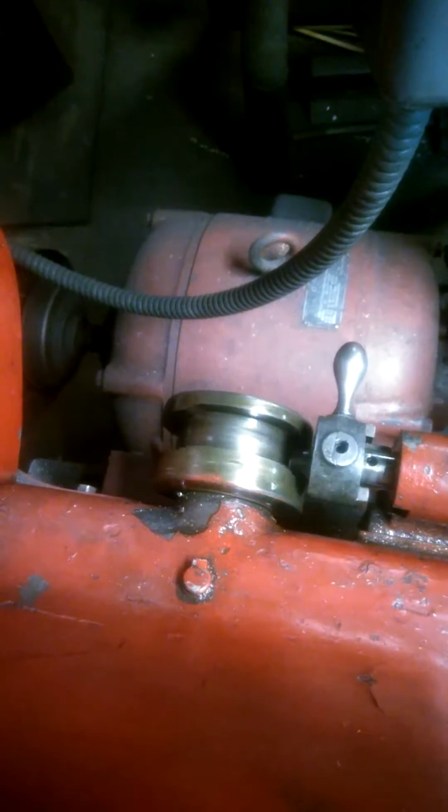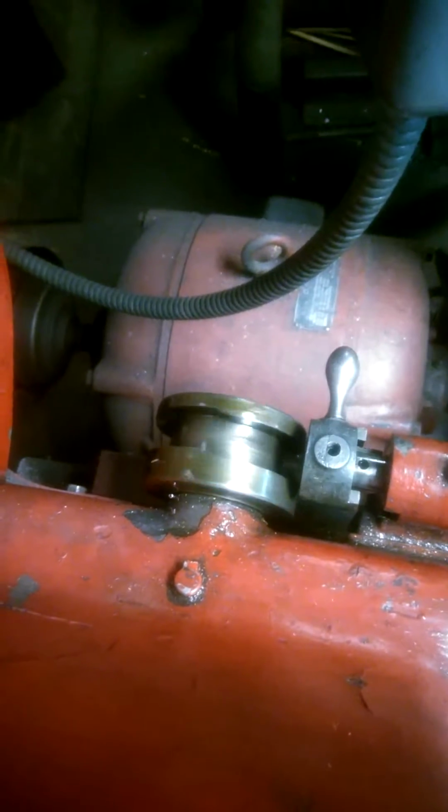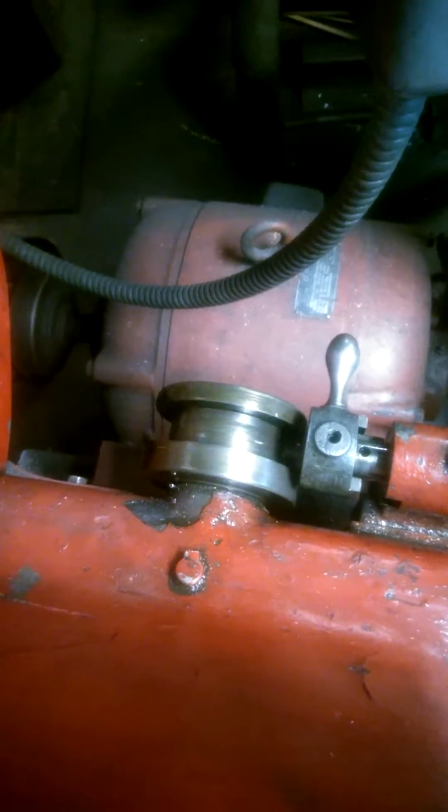Okay, the way this thing works is, in order to put a steep helix in, this machine is basically set up kind of like a lathe. This is a Fisher, and it has a cam. If you want just a steep helix, not a figure-8 groove or a straight groove, you engage that cam, and that comes on down over here, and at the back part of the stroke, it pulls the cutter away, and that's what gives you the steep helix. If you left it in there and didn't move it out, it would create a figure-8 oil groove. So anyway, that's it.